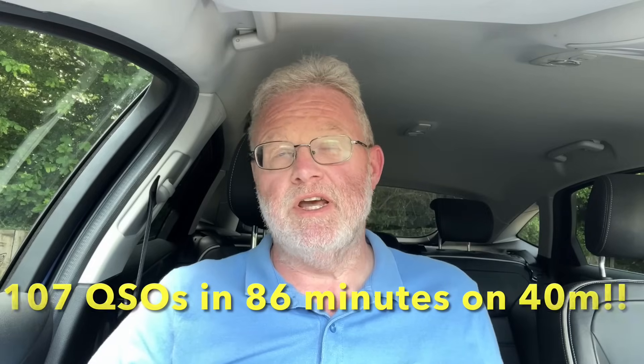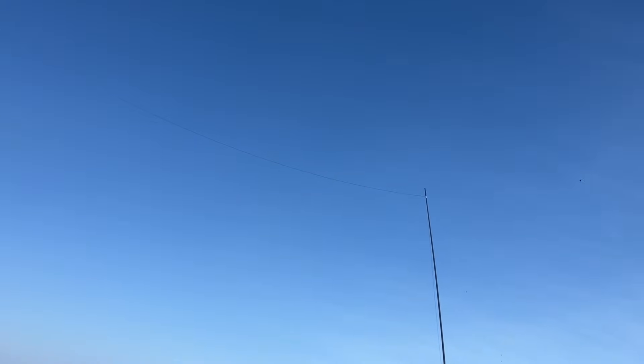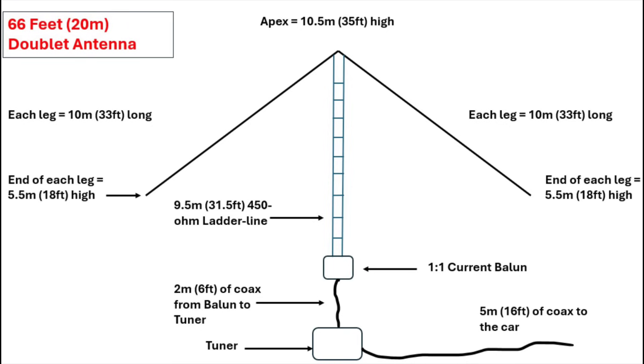I didn't use 12 and 17 meters because there was nothing happening on those bands at all — both were pretty dead, and even 10 and 15 were very quiet. But the star of the show, undoubtedly, was 40 meters. It's a dipole at a decent height, and personally — just a gut feeling — it was probably even stronger on 40 than the half-square I put up the previous week. The ends of that antenna were about a meter above the ground; with this one the ends were about 5 and a half meters up, so ground losses would have been a bit less. I was very pleased with its performance, and I'm pretty sure it'll do well on the higher bands too when conditions improve.